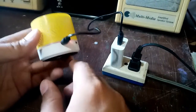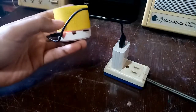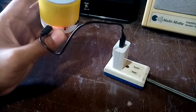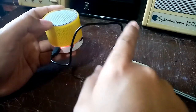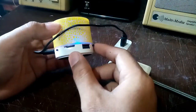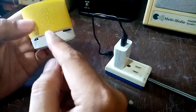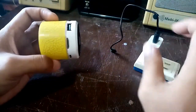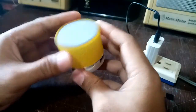Welcome to my channel. I have here a newly bought speaker, this is China-made. There's a red light — it is charging — but sadly when I turn this on with the charging cord into its power supply it will work fine, but without it it doesn't. So the red light indicates charging but it doesn't actually charge anymore. What I'm trying to do here is troubleshoot this one.